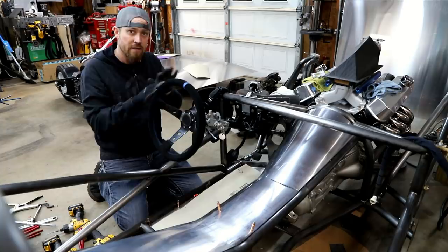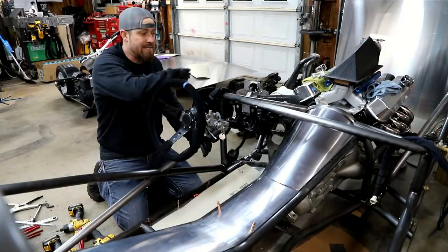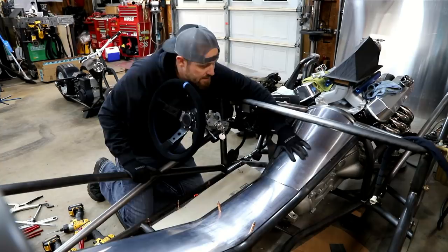Not to say that it can't be done, you could stretch that thing over your knee, stretch it on this side more so than that side, but then you run into the issue of having a nice consistent curve, and that's what you get with an English wheel. So anyway, turned out pretty nice, pretty happy with it.